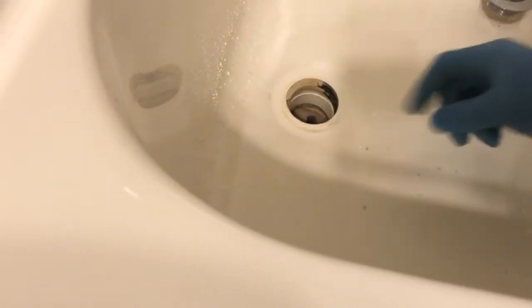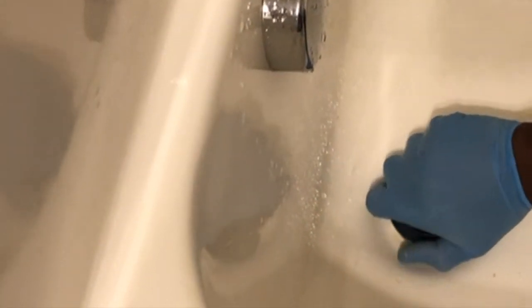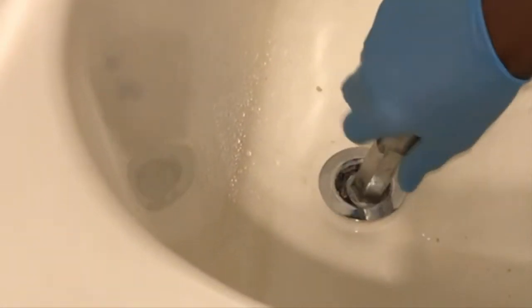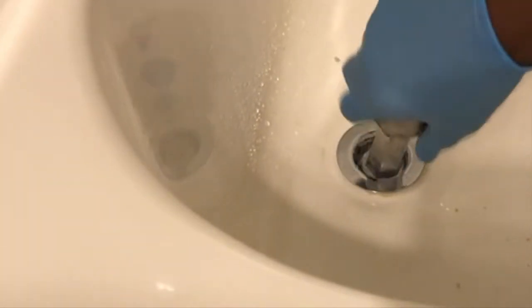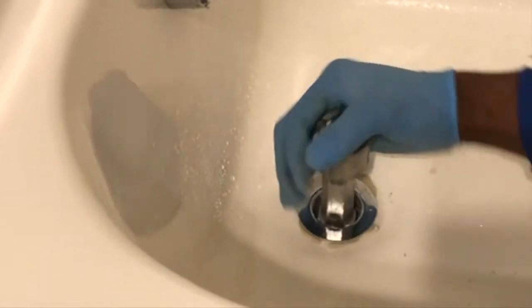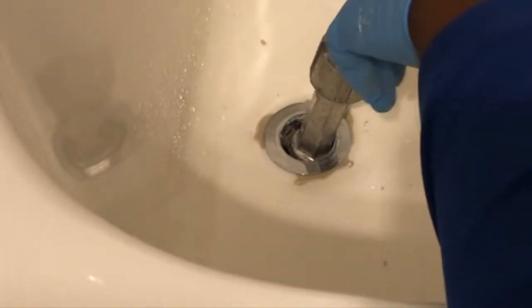What plumber's putty does is seal it and keep any leaks. You want this water to run straight down here. You don't want it to run underneath anywhere, even though this is a little gasket, but still, it helps to seal off. If you have it underneath here, you don't have to worry about leaks or anything. So I'm gonna work that down and just turn it back in. Where's my drain removal tool? That plumber's putty will go around here too, and it'll make sure the water is going inside the drain and not underneath the flange. You could also use silicone in some applications. Plumber's putty is used normally with metal on metal, and I like plumber's putty. Silicone, I like silicone too. I use silicone with plastic.